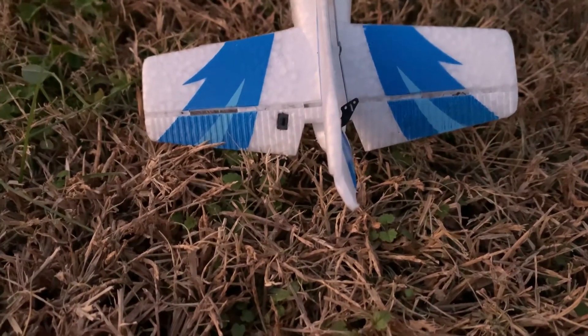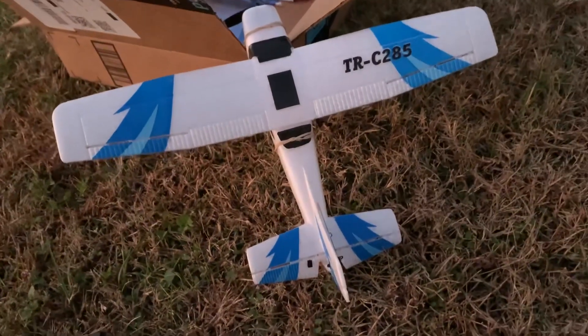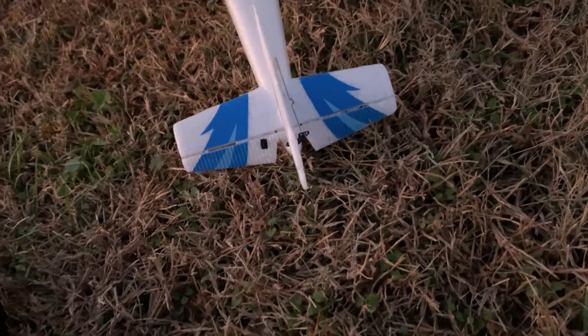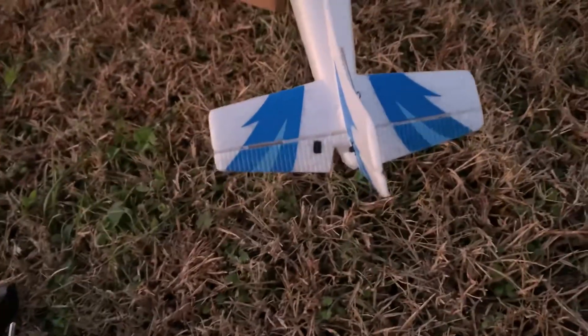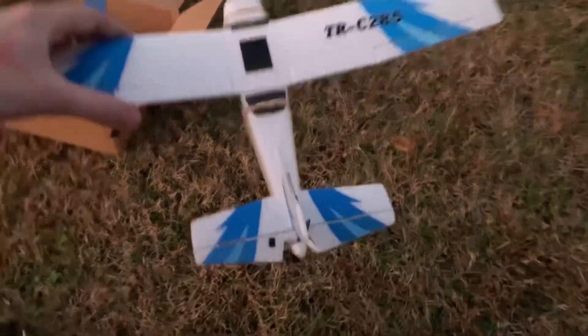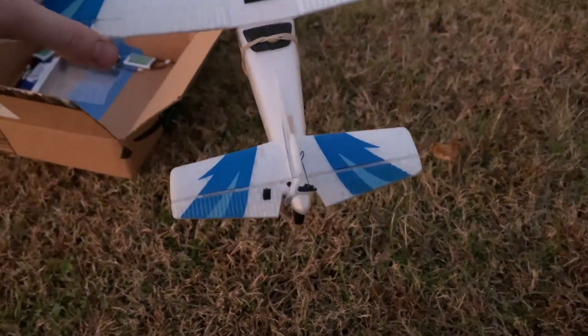Well, that's interesting. Now I'm going to let it just stay on the ground and rest. This is going to come back to center or roughly center position. So we will throttle up again here. The rudder is still straight. But after a certain vibration point — I'm holding the plane straight, even if I'm holding the plane right here it's straight and level — this harmonic oscillation has told our plane that we are rotating in crazy directions. That, for obvious reasons, works against us.